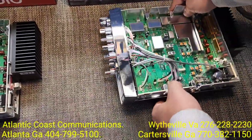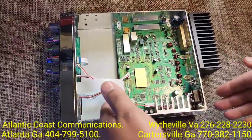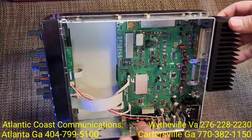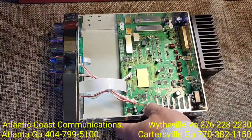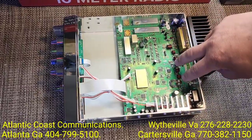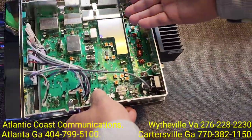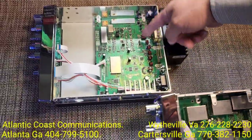It's a really nice radio. If we move over to the Gen 2, you can see that the board takes up significantly less space. They did leave the radio the same size to keep it in conjunction with the way the radio has looked in the past. But again, being the amplifier section here, you can see how different it is — where the Gen 1 has a shield here for the RF, we're lacking that on the Gen 2.